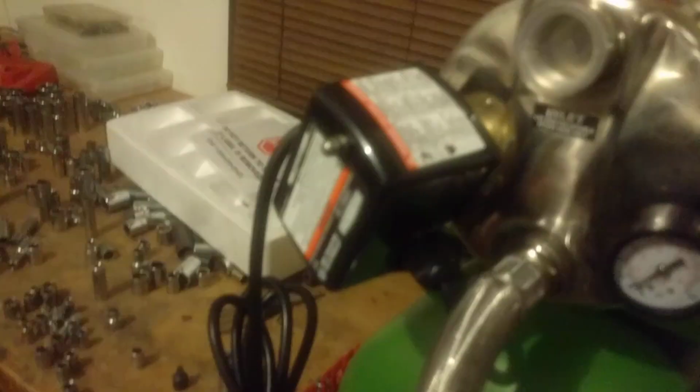So anyway, how I'm guessing this works, we got a pressure switch here. This I would assume is a mini version of what you would normally have with your well. Normally they're blue tanks and they have an air bladder inside of them. So what probably happens is here's your inlet. There was a note on here about filling it with water, so this is not a self-priming pump. And it makes another note that you gotta take this little plug off and fill it up with water.